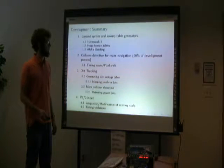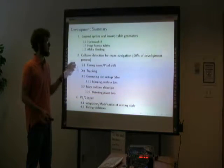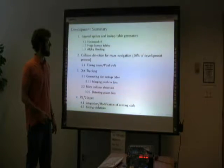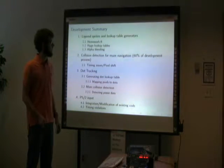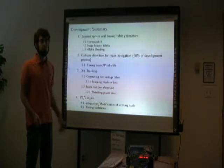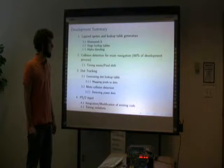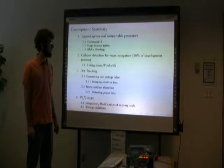The different parts of this project, in the order I developed them, were first the sprites for the images. They use lookup tables to store the images — essentially a two-dimensional array indexed by screen position x and y. Some of them were quite large, so I used software to generate Verilog lookup tables from PNG images. I then spent a good portion of development on collision detection for sprite movement on the screen and navigating Pac-Man through the maze, which required addressing several timing issues.